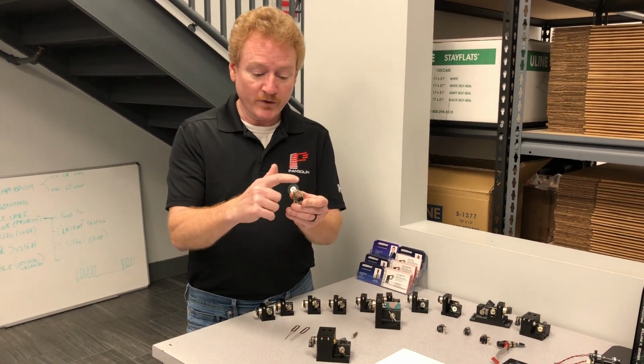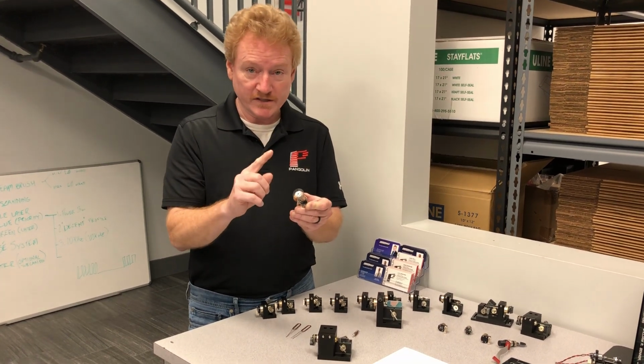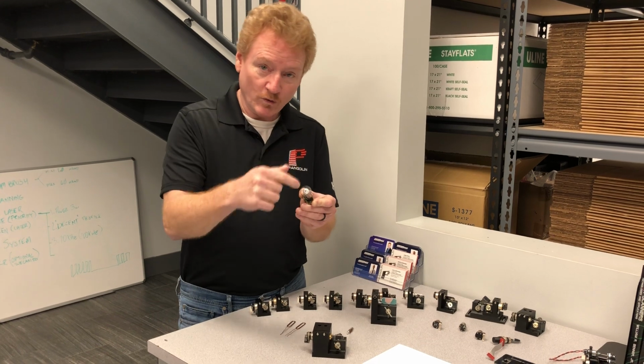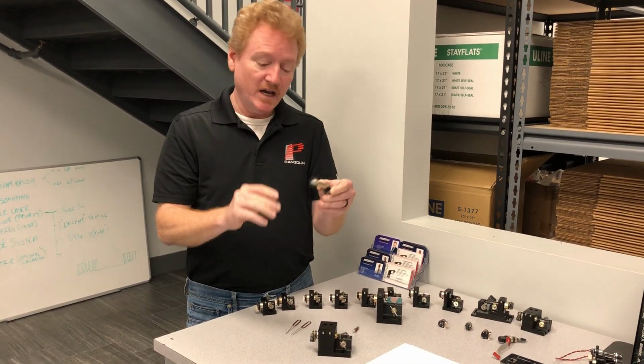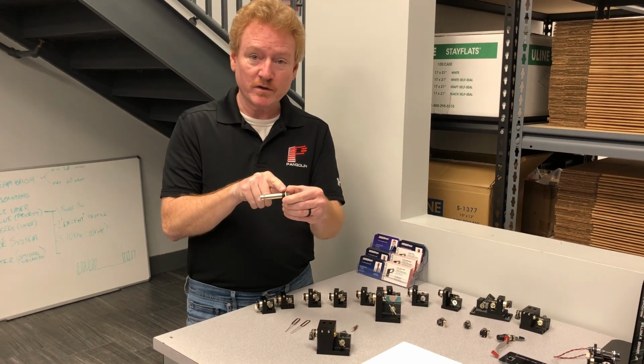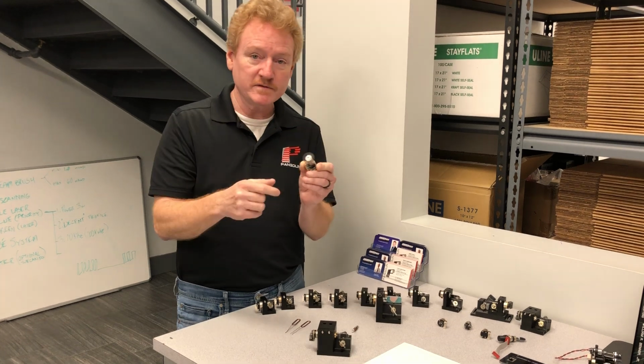a motor that's capable of 360-degree rotation and positioning anywhere within those 360 degrees. So it can run continuously, or it can stop. It can run forwards, backwards. It can position over any range of angles, and has a very precise position sensor on the back, which is capable of 17-bit precision within that 360 degrees.